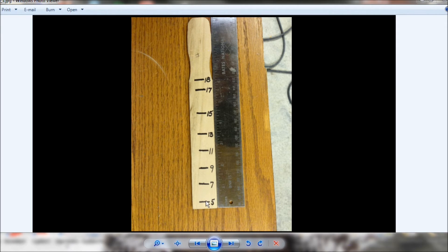Then I started putting two gallons in at a time — five, seven, nine, et cetera — two gallons at a time all the way until it was full. Then I taxied back to the hangar and took a picture of the dipstick next to a ruler, so that in case I lost the dipstick I wouldn't have to go through the whole procedure again to make a new one. I could just look at this picture and my measurements to make a new dipstick.